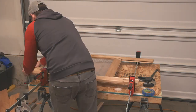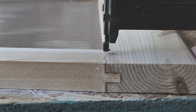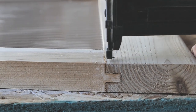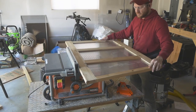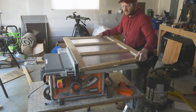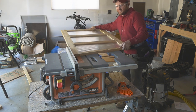I have a lot of faith in Titebond, but it's not unlimited. Just for some extra peace of mind, I decided to lock each of the tongues in their respective grooves with some stainless steel 18-gauge narrow crown staples. After the sides were complete, it occurred to me that I forgot one important cut — the grooves for the rear panels. That meant running the now glued-up pieces back through the table saw. A bit of an awkward move, but it worked.